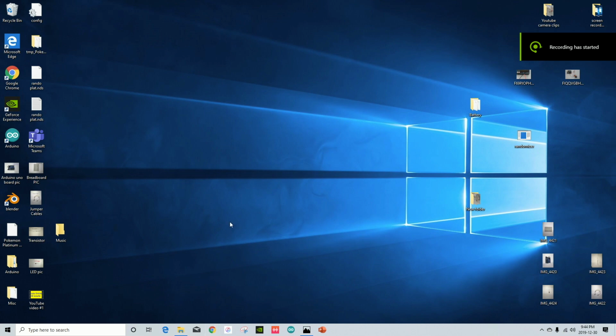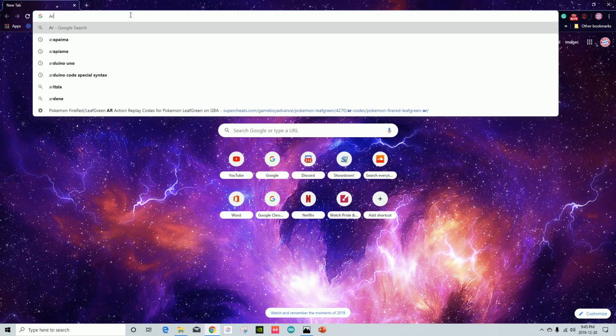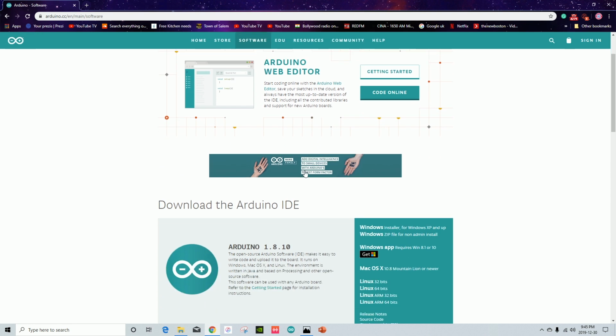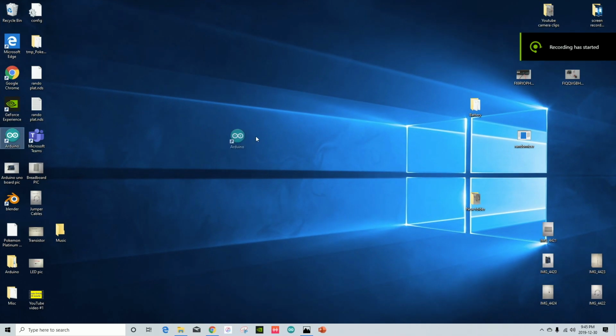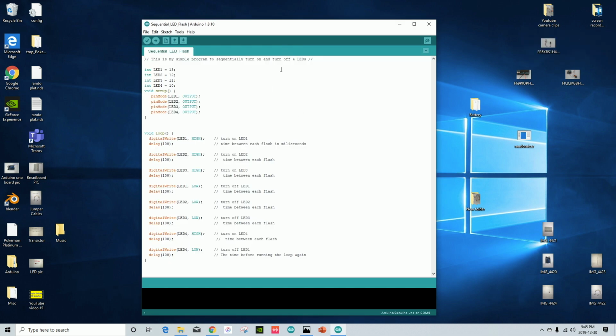Now, once you are done building the circuit, you're going to want to program your Arduino board. To do this, you need to download the Arduino IDE software. So after you get to the Arduino IDE website, you're going to want to select which one to download, depending on your operating system. Now, I've already downloaded it, so I'm just going to open it up. Now, when you open it, you won't see what I have here. That's because I already made this program. You can find all of this in the description below.